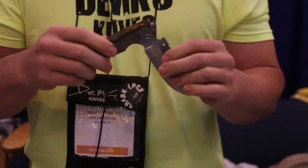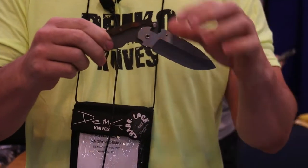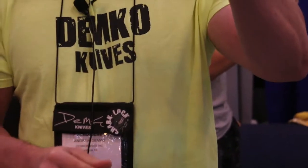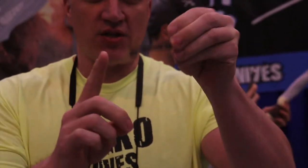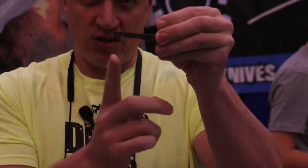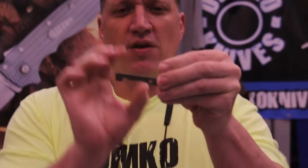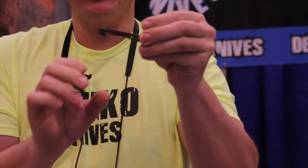One of those things was the interface between the stop pin and the lock face. The lock bar, or rocker, sinks in as it closes and wears, sinking in more deeply. What's interesting is this has an arced face, and this has an arced face also — two arced faces. They are not concentric, so when it sinks down it kind of wedges and tightens in.